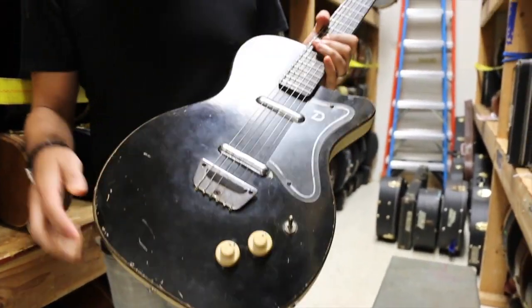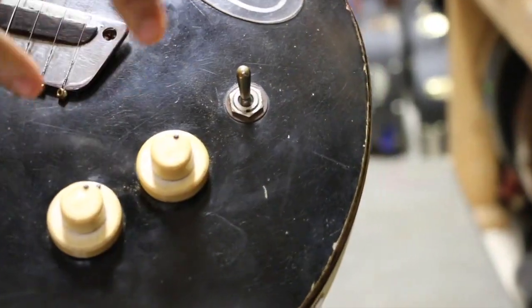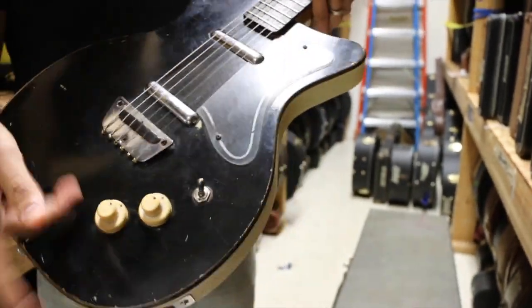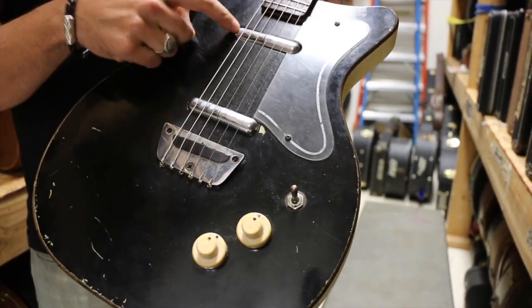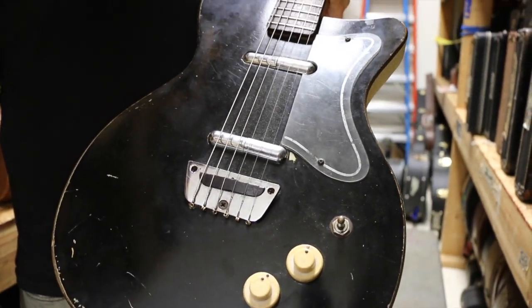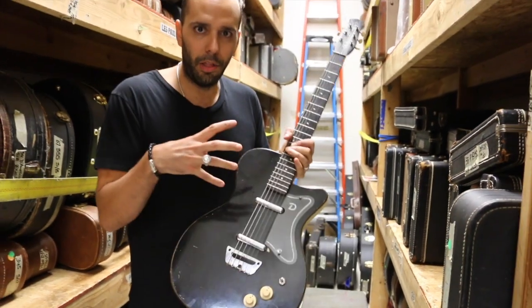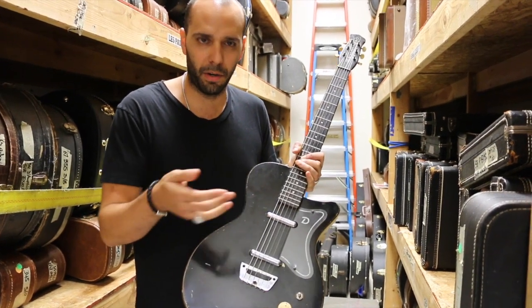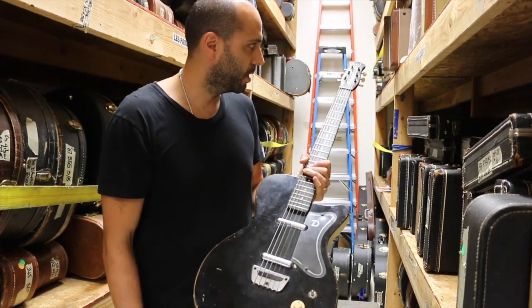Some other interesting features: we've got the concentric knobs here, kind of like Fender did on the early Jazz Bass with the stack pulls. This goes for your neck pickup, this goes for your bridge pickup — volumes on the bottom, tones on the top. You still have a three-position switch: neck pickup on its own, bridge pickup on its own. In the middle position, what's different on the Danelectros is that the two pickups get wired in series, so you kind of sum their outputs together almost more like a humbucker — a little more output instead of being run in parallel like how Fender wired a lot of their single-coil pickups. So your loudest spot is actually in the middle.